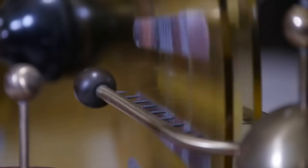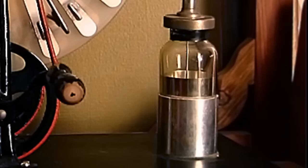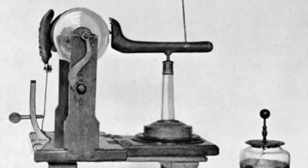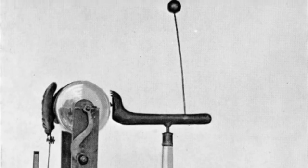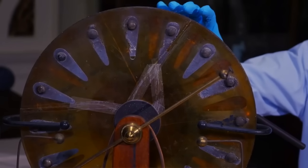The charge is picked up by these metal combs and then conducted to the Leyden jars, which are capacitors. Once the electrical charge has built up to a certain level in the capacitors, there is a lightning-like spark as the charge discharges between the ends of the adjustable electrodes. These were a big improvement on earlier machines which used triboelectricity — more reliable and able to reach higher voltages, and because of that they were used in early X-ray machines. The whole thing works on a process called induction.